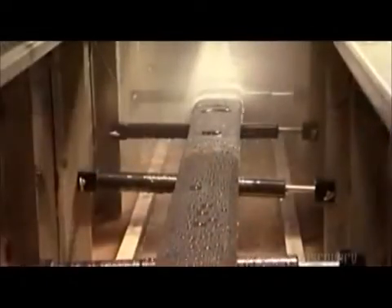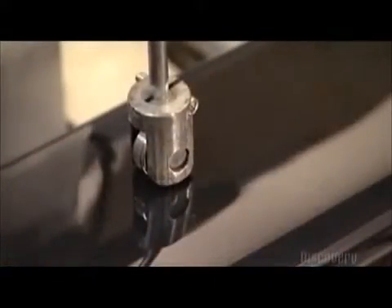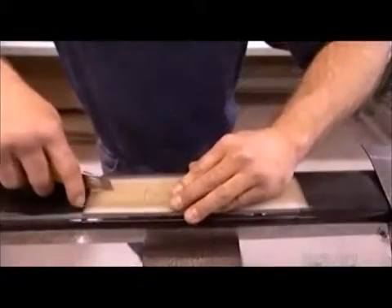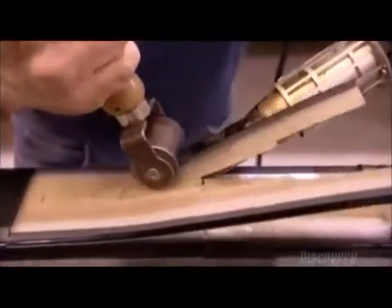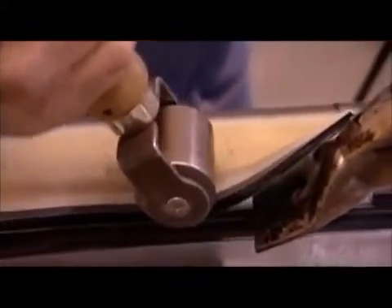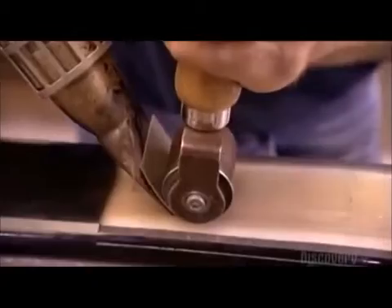What comes out is a strip of plastic-encased wires and sliders. The handrail shape passes through measuring devices that check its dimensions. Now they splice the ends of two plastic handrails together to form an endless loop. Using a roller, a worker presses the wires and plastic sliders of the inner carcass together. As he rolls, he blasts hot air into the splice with a heat gun, which softens the plastic so that it melds together.